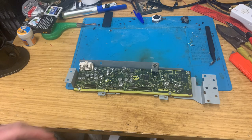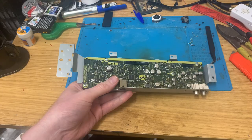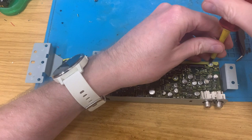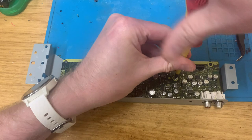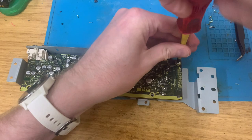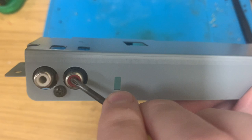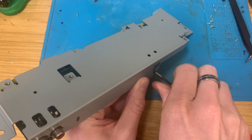Now, I've got a cable. I suppose we could probably undo these other screws and just have a good look at the board. Now, I know for a fact, because Paul pointed it out, that one of the phono socket port things has something stuck in it. So that obviously needs to get sorted out. That could be the entire problem. It could be shorting something out.